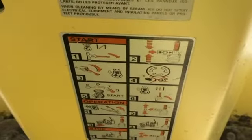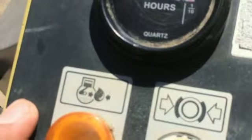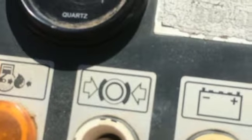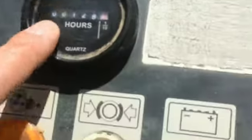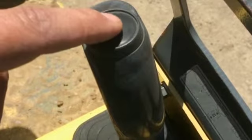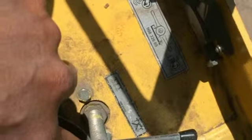This is your view from the cab. There's your starting instructions right there. This is your choke. Here's your steering wheel. This is an engine oil pressure light. This is your kill or brake light. This is your hour meter — it doesn't have a light in it. This right here is your forward and reverse lever; the button up at the top is your vibratory. This is your engine RPM speed, and this right here is your gravity flow watering system — this increases or decreases your water.